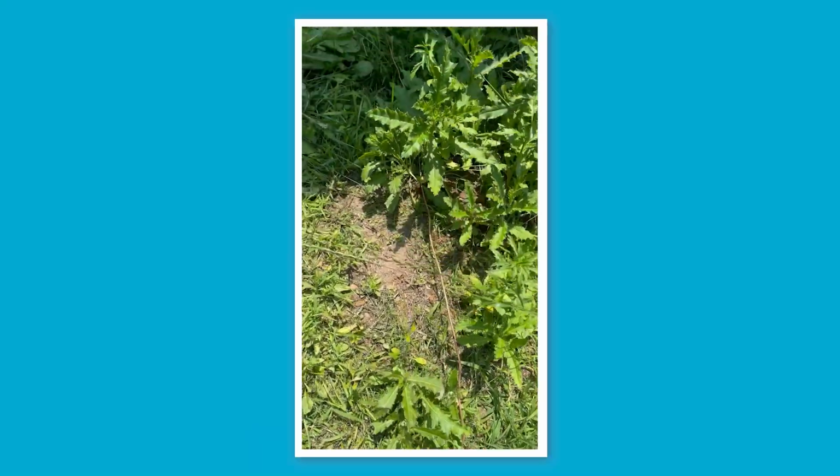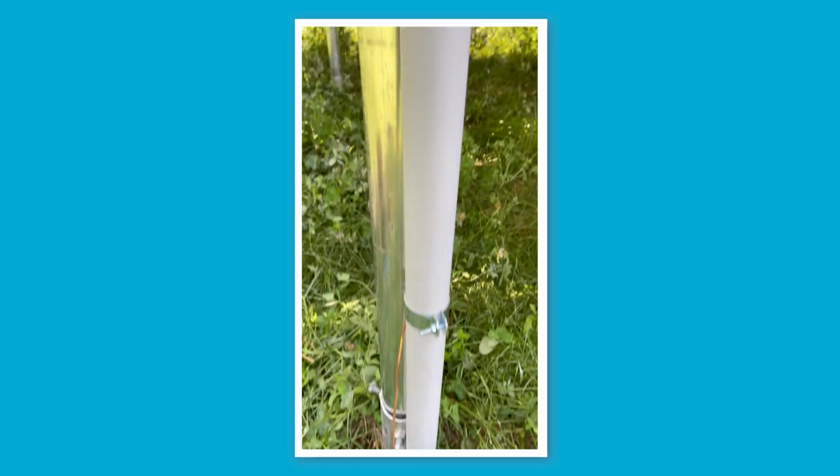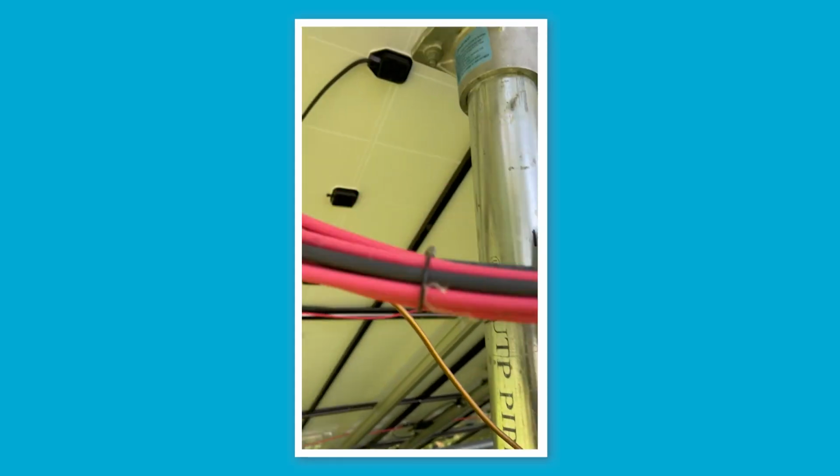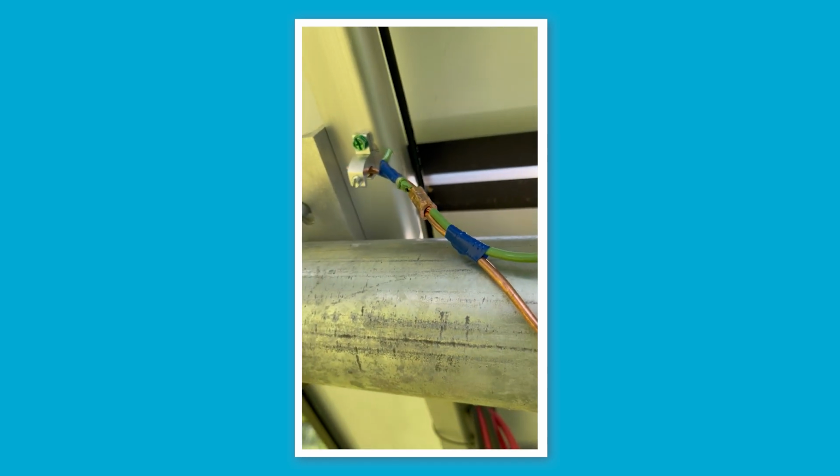Grounding electrode number 1, number 8 continuous, grounding electrode number 2, continuous without interruption, up to a grounding location with an irreversible crimp to the number 10.